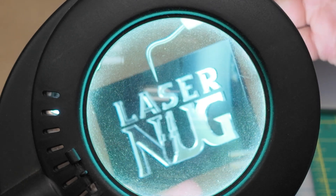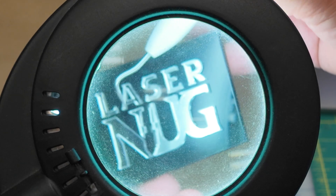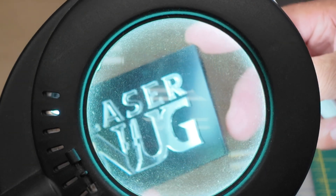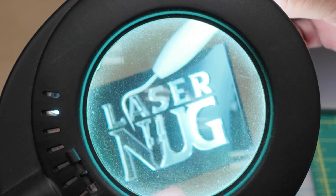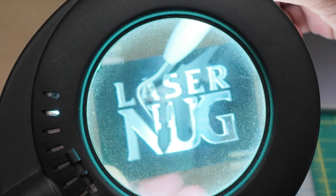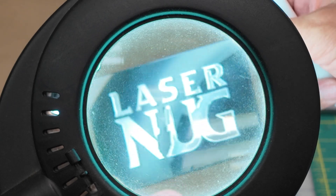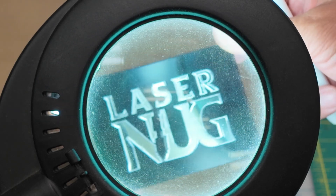In contrast, along the sides of the A, N, and U, I took the Weld-On number 4 with the needle and was able to apply it. In each case you can see the number 4 just sucks underneath, welds from underneath, and you don't see any discoloration or any evidence that you glued or welded it.